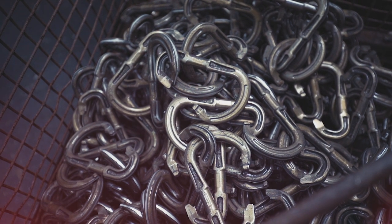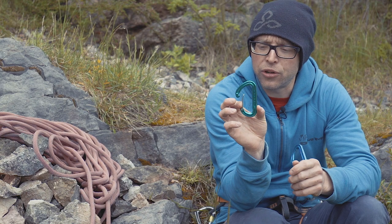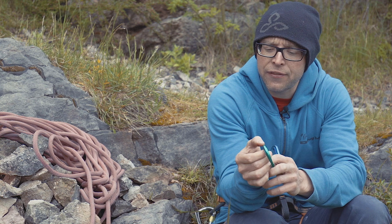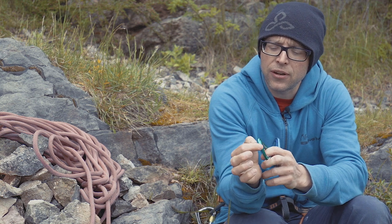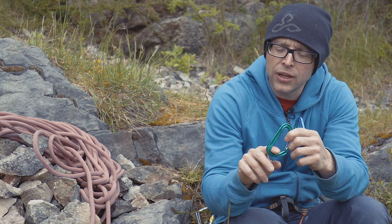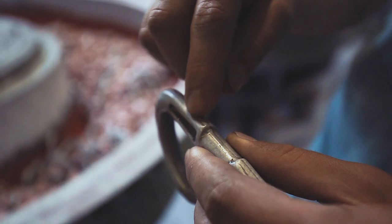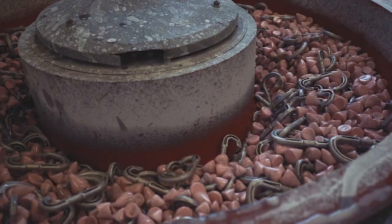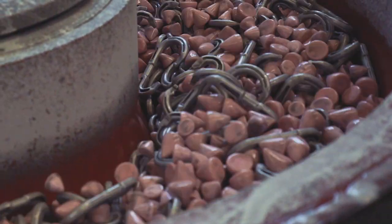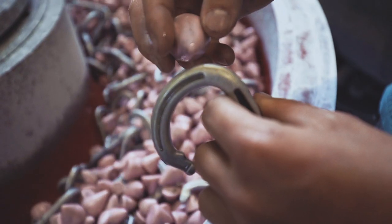After that, we've got a carabiner which looks pretty much like this, which is good and strong. But from that clipping there'll be a few little edges around the carabiner — the critical point being where your rope might run. So to get the carabiners a really nice, silky smooth finish, they get put into a rumbling machine where all the carabiners shake around with a bunch of ceramic pyramids and ceramic chips, which knock against the carabiner and take off all those little sharp bits of metal.